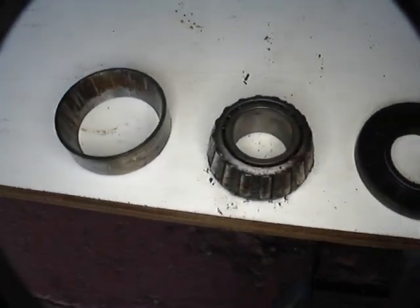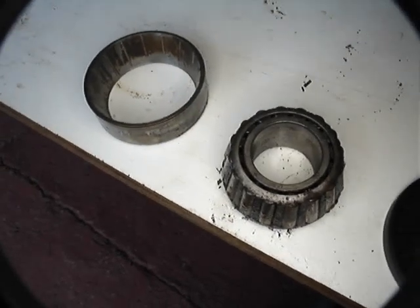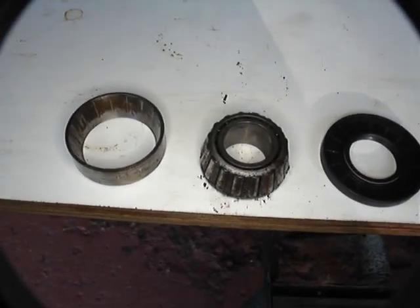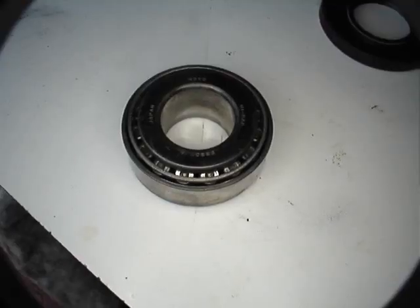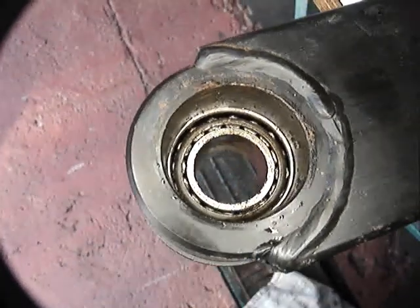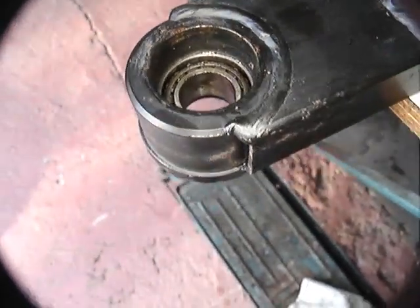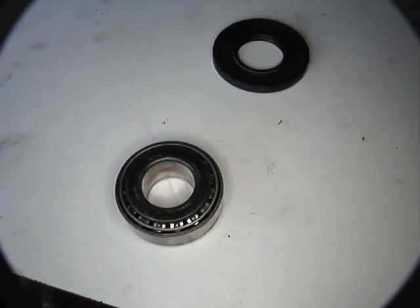There's a seal which appears to be in quite nice order, and the bearing is looking a bit greasy but not very - makes me wonder if it ever had any grease in it at all. It's looking a bit brown and untidy. I'll give that a good cleanup and examination and consider whether or not we should replace it. Our bearing hasn't cleaned up too badly, and looking in the other side - the side which did have a cap on it - there appears to be no grease behind that either. So I'm going to knock that one out, give it a good cleanup, check it over, then pack them both back in with grease. And of course, a new plastic cap for the one that was missing.